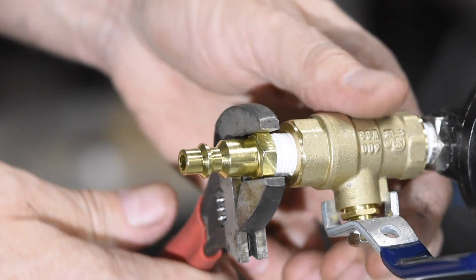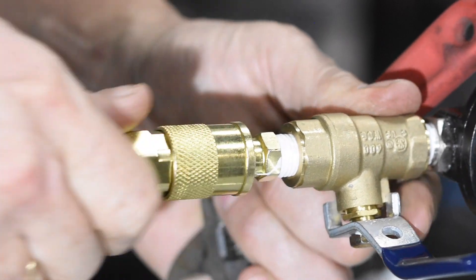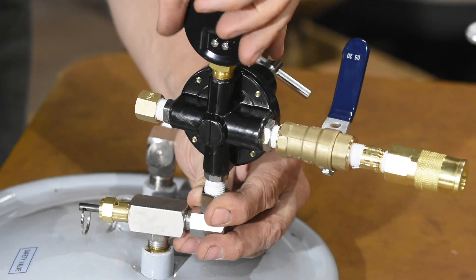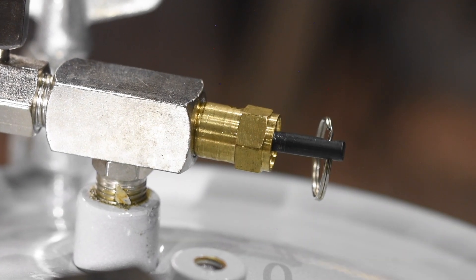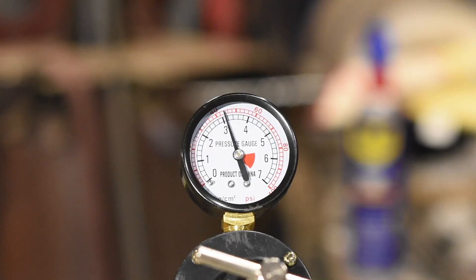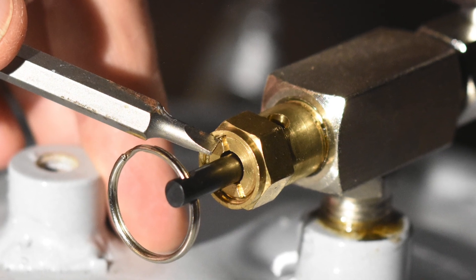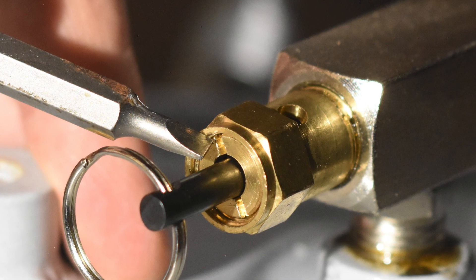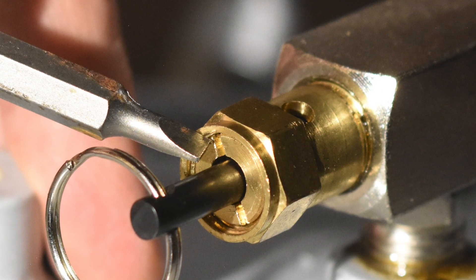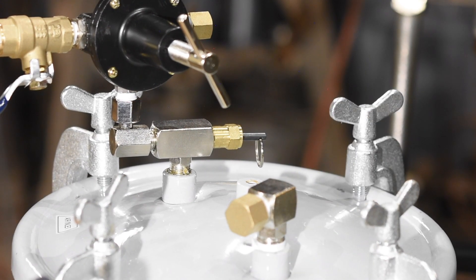But this is how it ends up for me: male on the pressure pot side, female on the airline side. The pop-off valve is set to vent at about 30 psi, but I plan to run at 50. Max pressure for this pot is 60 psi, so I'll run it at about 50 just to be safe. The pop-off valve has a little slotted screw adjustment. With a thin-bladed screwdriver I didn't have much trouble — you screw it in to increase the pop-off pressure, and back it out to decrease it. I've got it set now for about 55 pounds: enough to be safe, but not enough that it'll go off when you pressurize to 50 pounds.